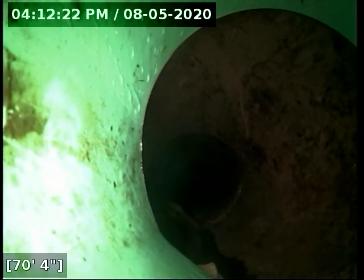And on another note, more uncapped cleanouts. Out right next to the driveway, you'll see a big green piece of pipe sticking out of the ground with no cap on it. It's been partially broken. That's the sewer cleanout that's just sitting there wide open. So these things need to get caps put on them or you're going to get rocks thrown down them by neighborhood kids. I have seen it a million times.